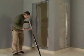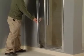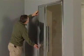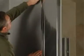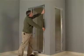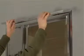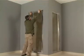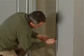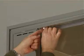After we have applied silicone to the door's external cornices, we install them by means of a practical system which makes it possible to adapt the profile to the different thickness values. We can now tighten all the door screws and insert the closing plugs of the compartments housing the screws.